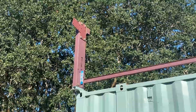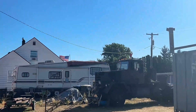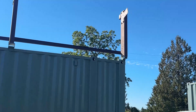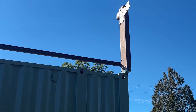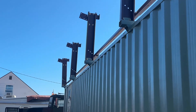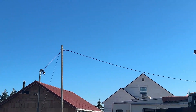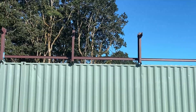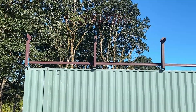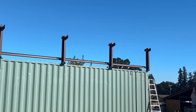Going up as straight as I possibly can, and making sure that it has the best possibility of fitting the roof. What I'm going to do with the other side is leave this side loose, so that when I put the roof truss on, it will be able to move around a little bit, and hopefully I can wiggle things into place if it just needs a little nudging. So all of this side is loose, all of the other side has been tightened up, and I am going to put on the upper girt — it's basically the piece that goes across there — and tighten it up.